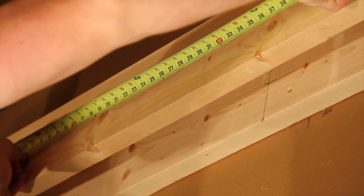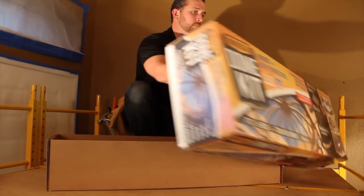Now that we have finished the light prep work involved, we are ready to begin installing the Universal Dome Kit. It basically involves three simple steps: installing the dome ring, setting the dome tie, and then installing each dome rafter. Yep, that's it. We'll begin by measuring and marking the center of our 5-foot box on all four sides.